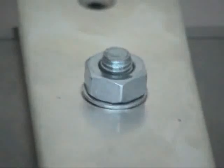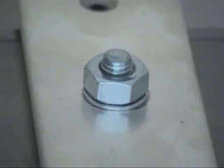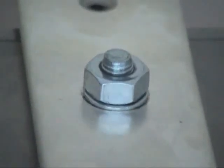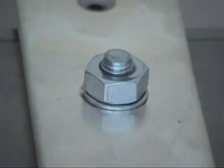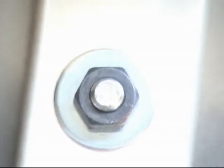In this first test, a bolt is placed in the machine and tightened using a plain washer and plain standard nut. The clamp force, or bolt preload as it is sometimes called, is measured and recorded by a computer connected to the test equipment. Once the test is started, standard nuts quickly self-loosen. Speeding up the video, the self-loosening of standard nuts during this test becomes obvious. As the loosening progresses and the nut rotates, the force present in the bolt reduces.